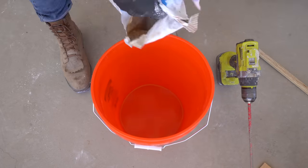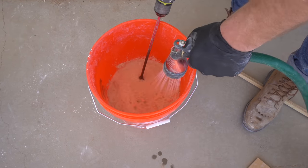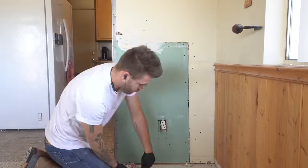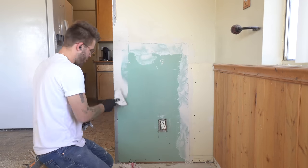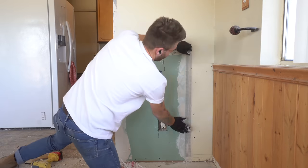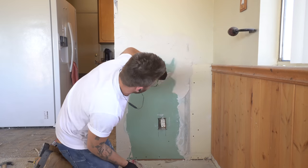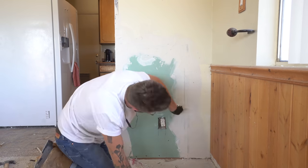The joint compound that I'm using is a dry mix called Fast Set Light 40, and the number 40 indicates that it has a 40-minute set time. For this project it'll work great, but if I was doing something larger I would use 90-minute joint compound, that way I could work with it longer before it dried. I applied a heavy coat of this into all of the cracks in the corners, and then I used drywall tape everywhere that I had old and new drywall meeting. The old drywall is a little bit thicker because it's got texture and paint on it, so we're going to need to build that up on our second coat to match.